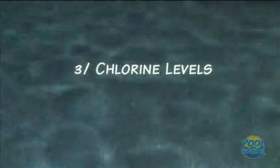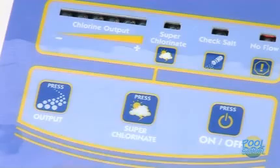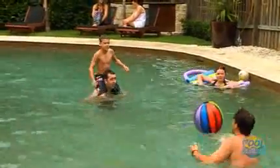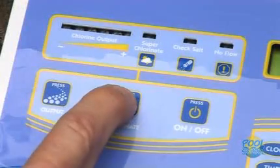Now that we've checked the chemistry of the pool and cleaned the electrode, if the chlorine level is a bit low, the Zodiac saltwater chlorine generator has a boost button that will superchlorinate your pool. If you don't have a Zodiac branded chlorinator, then you might have to shock dose the pool. If you do superchlorinate your pool, the chlorine level will go high for about a 24-hour period, but after this time your pool will be sparkling and clean, ready for swimming. If your pool starts to go cloudy or green in the peak of the season, you might need to shock dose or superchlorinate. Likewise, if there have been a lot of swimmers, high temperatures, or heavy rain, these will all dilute the amount of free chlorine in your swimming pool. A shock dose of chlorine will help prevent these problems from occurring again.